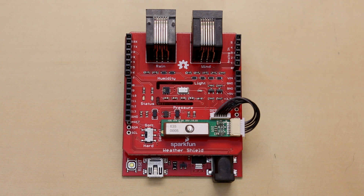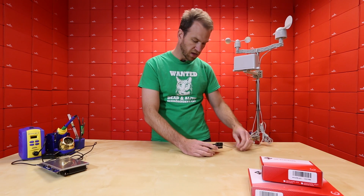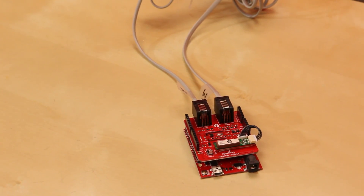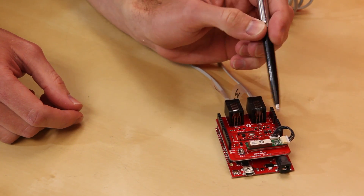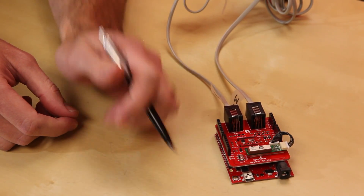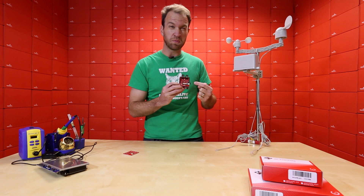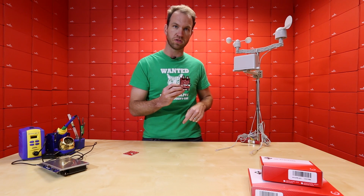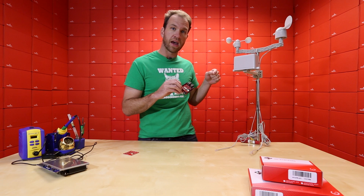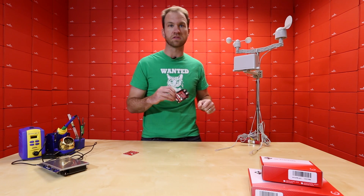This is what it looks like built up, including the extra GPS module and the two connectors for the weather station. If we connect that to the rain gauge and connect that to the wind gauge, we get a rather powerful weather station connected to Arduino. This black square is the humidity sensor, the silver rectangle is the barometric pressure sensor, and that small sensor right there is the light sensor. Combined with GPS we get an all-in-one package. The two connectors are for rain and wind. Out of the box this board works with the GP635T GPS module, but it'll work with any other GPS module you can hook up a serial connection to. It also works with our weather meter that has wind speed, wind direction, and a rain gauge, but it'll also work with any other weather meter you can wire up.